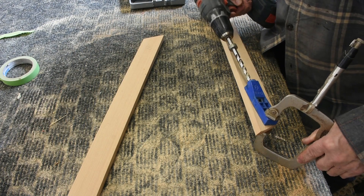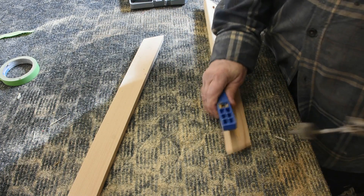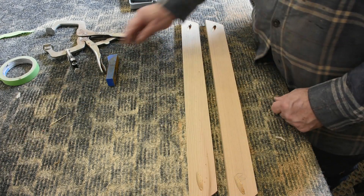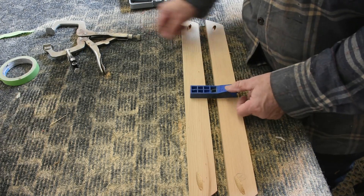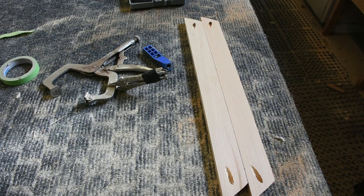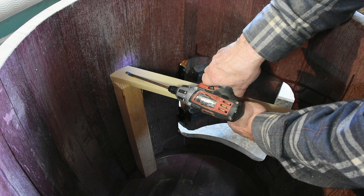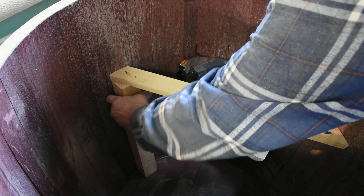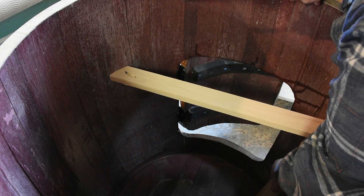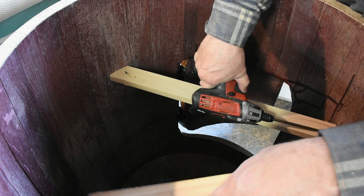I just have a portable pocket hole cutter, lining up where I'm going to put the holes — this is how I'll fasten the supports to the inside of the barrel without running any screws on the outside. When I install these I pull them tight, then slacken them off about an eighth of an inch. I glued a bit of sandpaper on the jig so it doesn't slide around. There's the shelf all cut and sanded with the supporting boards. I'll get these all in, then go back and slacken them off to allow the barrel to expand and contract — they can move in the pocket so the barrel won't rip out the screws.